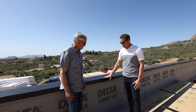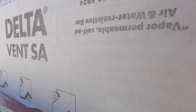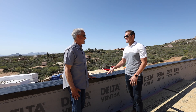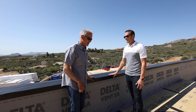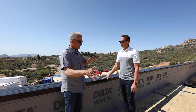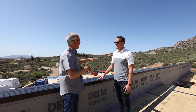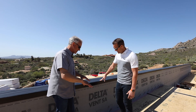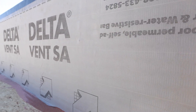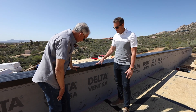Another important detail — as mentioned, we have the waterproofing because we're going to have the SIPs over the Legacy. Talk about that detail and the challenge for builders when you have a parapet — I love modern homes but the parapet always gives you cause for concern. Flat roofs give us cause for concern too. Even in Arizona with six to eight inches of rain a year, flat roofs have to be designed knowing water may get through. What we did here: the Legacy comes down, we liquid flashed the joint between the Legacy and the ICF, then the weather protection layer came down and embedded into the Prosoco fast flash at the bottom.